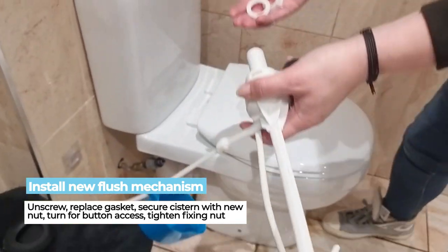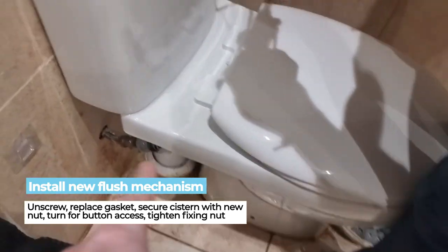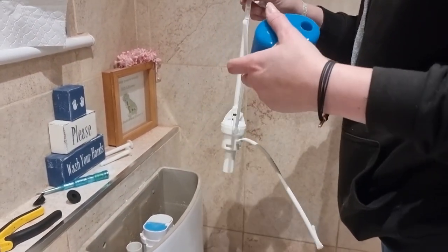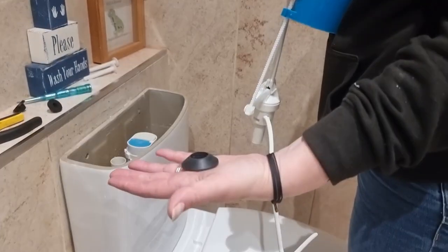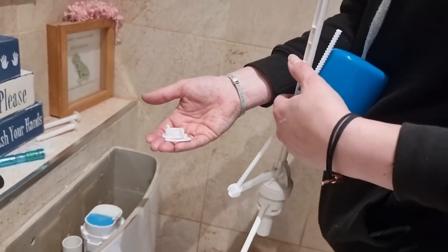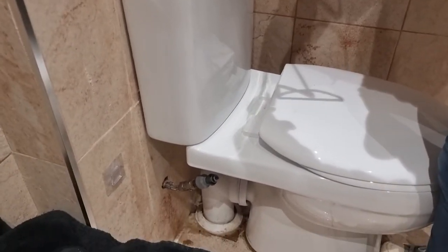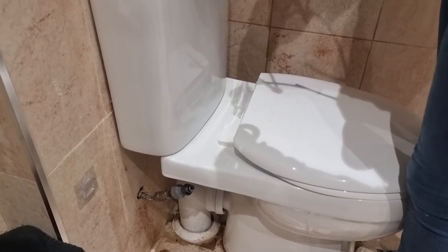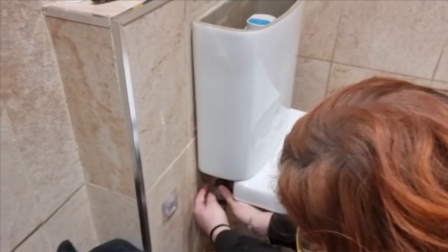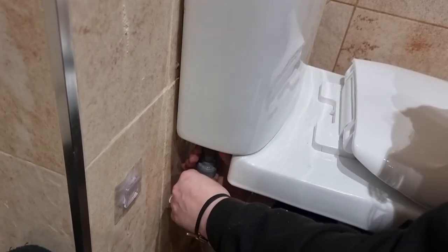Once you've replaced the old unit with the new, you'll move on to the valve, which is the inlet valve for the water, and this will go through the hole, which the original one was in, which is there, down into the pipe. You'll start by unscrewing the end of this. It has on it a new rubber grommet to replace the old one, so there's no new leaks or seals, and also the coupling device there, which is used to seal it. Once you seal this, please make sure it is as tight as possible so that there's no water ingress or out from this that can leak anywhere, which could cause any damage.